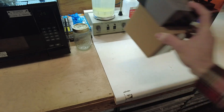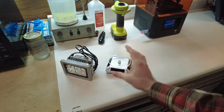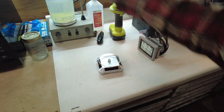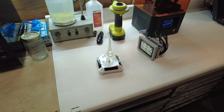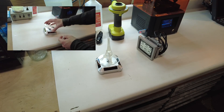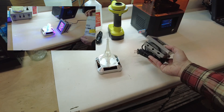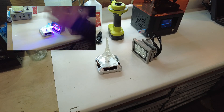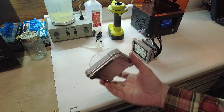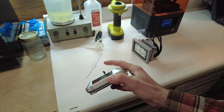Another popular thing to do is go on Amazon and buy one of these kits. Inside the kit is a very inexpensive UV light that plugs into the wall and one of these solar turntables. The idea is you plug the UV light in, put it off to the side, and place your part on the little solar powered turntable. It spins it around in front of the UV light until it's properly cured. In practice though, the biggest issue is that you're really not supposed to look at these UV lights while they're on, so you just have to turn it on and leave the room. You also have no way of knowing that you've exposed it for long enough. And honestly, this thing is just a piece of junk — good luck putting anything that weighs more than an ounce on it, otherwise it's just gonna break.